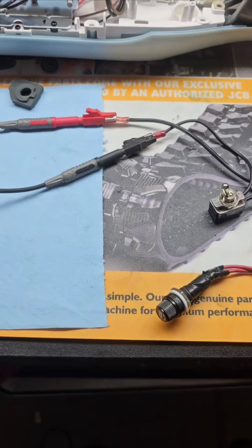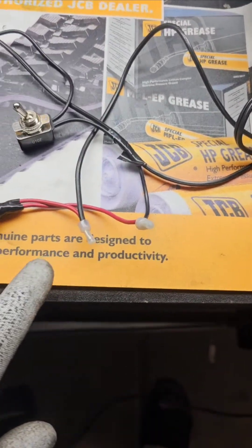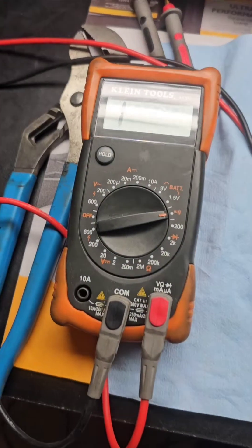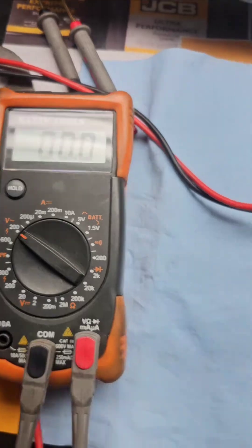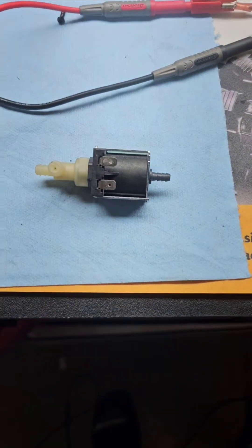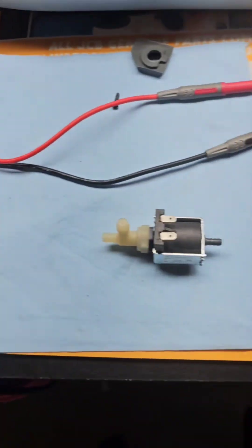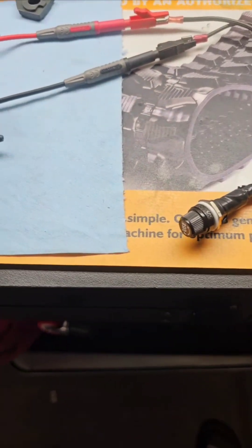In order to test this, I'm pulling 120 volts straight from an outlet. I got an old lamp cord and I ran one line through a 0.5 amp fuse and a switch. I'm going to put this on 200 volts AC and plug this bad boy in. First test to make sure I got the voltage, and then I'm gonna give this bad boy 120 volts - fused of course - and see if this thing changes states. Here we go, switch on - got 120. Now I'm gonna turn this off, plug it in, stand back, and flip the switch to see if this thing changes states.